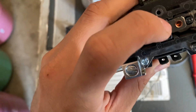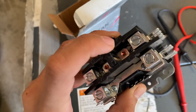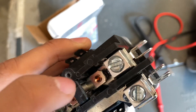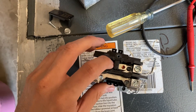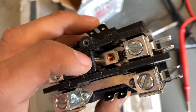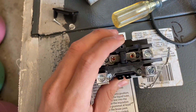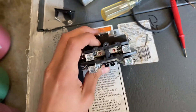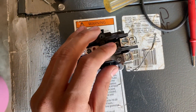Spider webs or ants can get in there. We're in Texas, so there's a lot of ants — they can get the contacts pretty pitted, and that'll stop voltage from going across. If ants get in those contactors, it's best to replace rather than trying to clean the contacts. Also, over time if you've had a contactor 10-plus years, the contacts get pitted and start arcing, and that can cause a voltage drop.